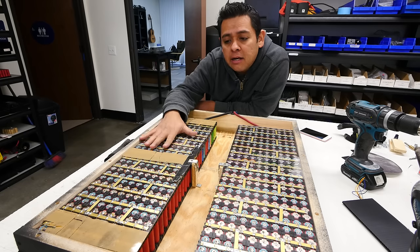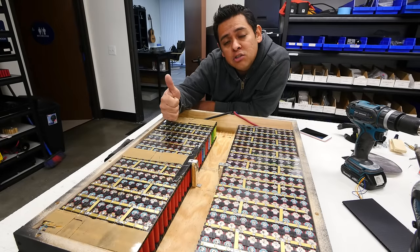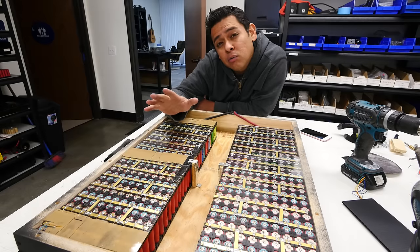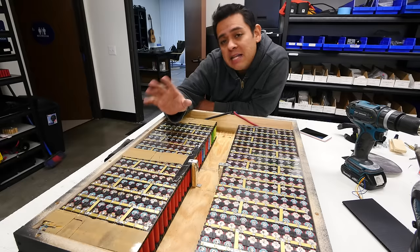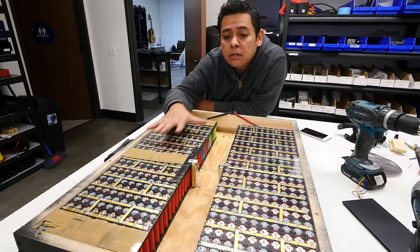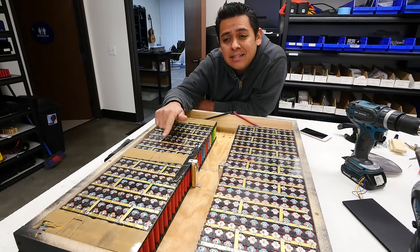And so they're usually set up to work either on 12 volts, right? The smaller ones. And then the bigger ones start working on 24 volts, 36, or 48. I think the biggest ones that can run an entire house usually run on 48 volts. And so depending on which inverter you're going to choose to use with this cell, that's going to determine how you're going to wire these cells. How do you do that?